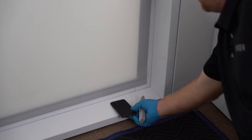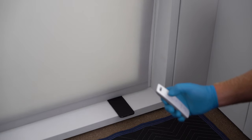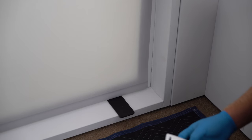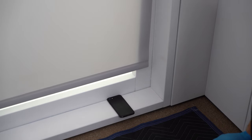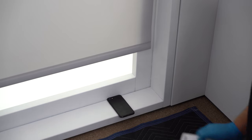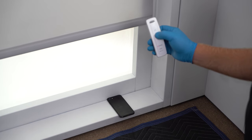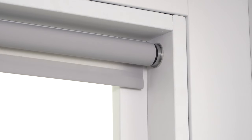You want to run it down past the ground or the bottom of the sill a little ways, just to ensure it's on the tube snug, then start working your way back up. I like to take a cell phone — just something that I can have in that room that will always be the same — and run it all the way down until it touches the phone, jog up once. Once it's off the phone, hit the up and My buttons. Now top limit is set, bottom limit is set. Hit the My button once to stop, then press and hold the My button. It'll jog, and that'll take it out of programming mode.